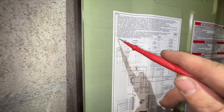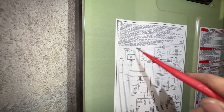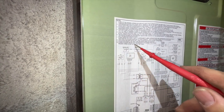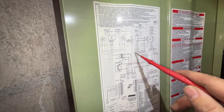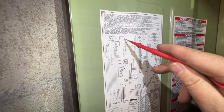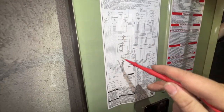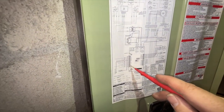It says there's a harness note — connection 10 may or may not be present. If the connection is not present, wires 33 and 34 will not be used, which is these two, and they are connected to this. However, I also see a wire here which goes to pin four on the motherboard.